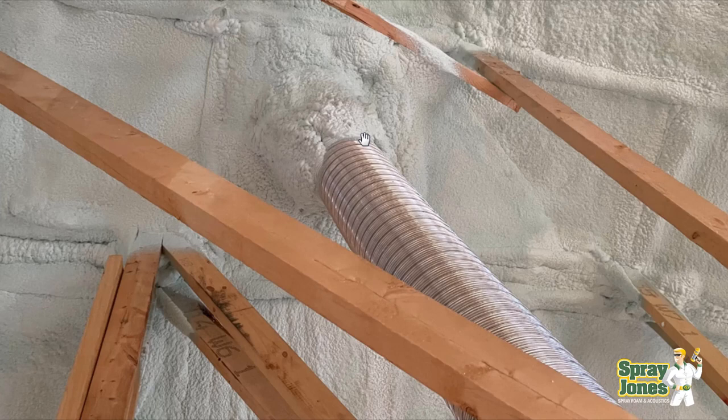Here's our image — they've installed the extension pipe and stubbed it up. We've completely sprayed in that square, sprayed in the thimble, and then come down the outer lining of the vent pipe. The reason is that the cold air being drawn in can warm up and not immediately frost up, condense, and drip right at the roof line. We don't just spray three or four inches around the pipe at the roof deck — we spray around it and come down, like we do on a plumbing vent stack, maybe a foot or two feet.